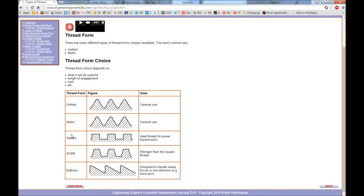If we wanted really good power transmission — accurate forces going through the thread — we could use a square type, but a square type is very difficult to manufacture. So oftentimes we use an acme thread: it's stronger than a square thread, not quite as accurate, but a lot easier to make. If we wanted to handle a heavy force in only one direction, like a truck jack, we could use a buttress thread. We're going to use an acme thread because it's fairly strong — good for a vise — but also easier to manufacture.